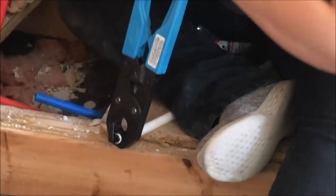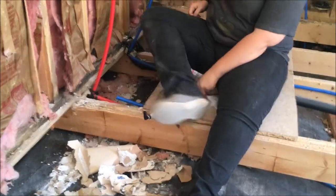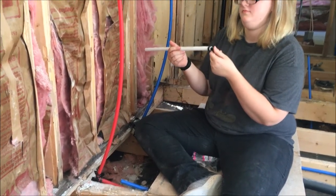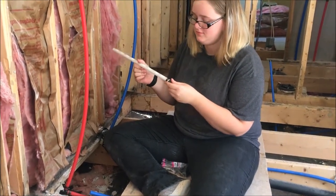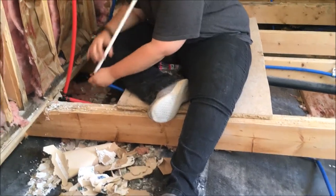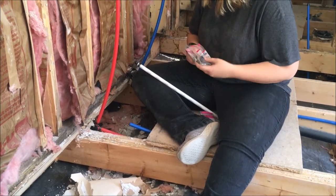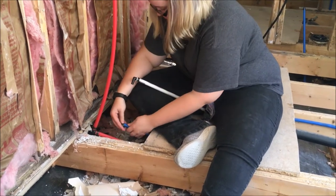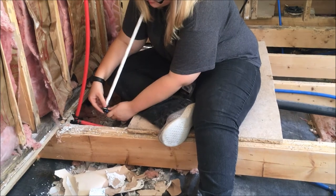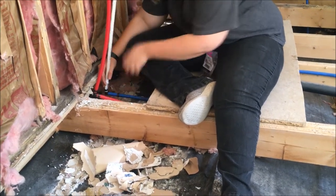She's got it. When you hear that click of the tool handle hitting the other side, that's when it's crimped. When you look at it, make sure it's not crooked and that the elbow is still placed well. You always have to remember to put the crimp ring on the pipe before the fitting goes in, but the fittings aren't hard to take in and out — they're easy to deal with. You just push in and make sure they're seated well.